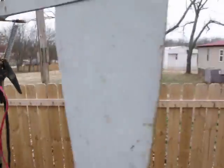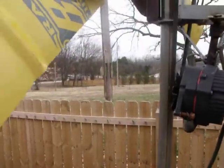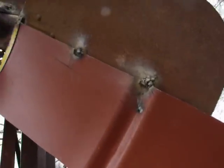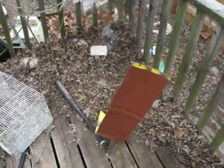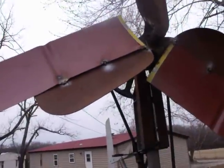One thing I would like to show you — I originally had it just with this old chicken house fan blade on it, but it just took such high wind to spin it. I went and cut 7-inch wide blades out of a 55-gallon drum and just tacked them on there, thinking it's just a test. Well, I had some 15 mile an hour wind gusts yesterday and they flew off, stuck in my porch, and completely crumpled the blade. So I learned a valuable lesson: if you're going to do something, even for testing, just weld it on there right — don't just tack it.